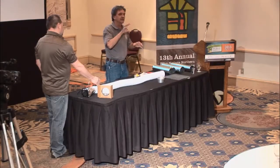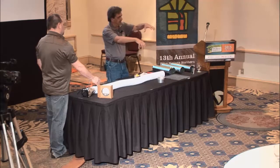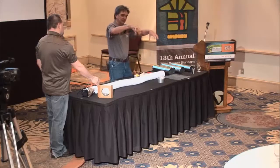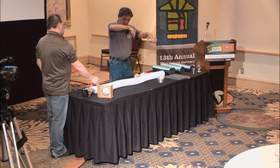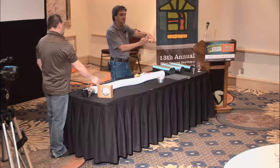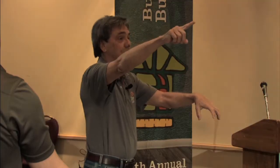Now, this lady's got a problem with her bathroom, and one of the things I suggested, she says, can we go out the sidewall? Yeah, but it's really a short duct, and the cold comes back. And particularly the wind can come back in. And then you'll get complaints and they'll block it off, they'll tape it shut with duct tape.